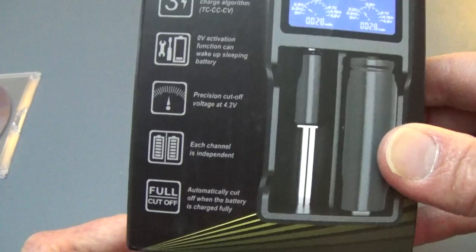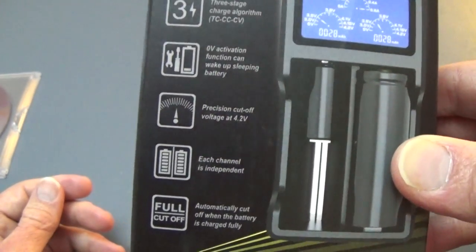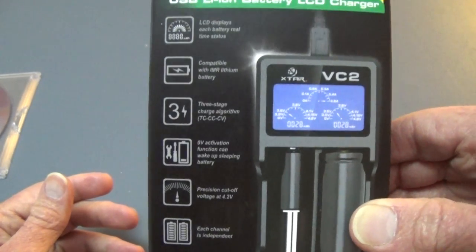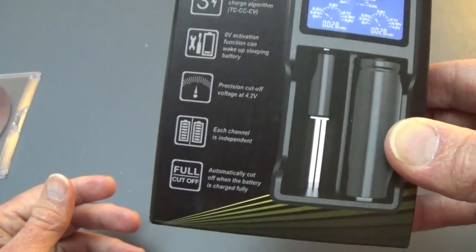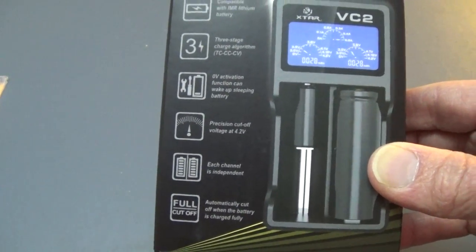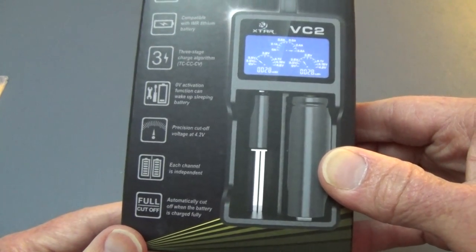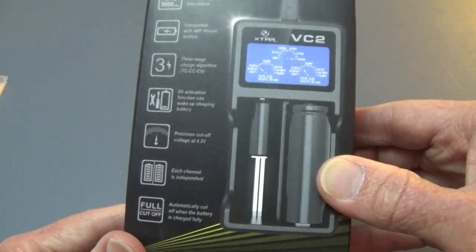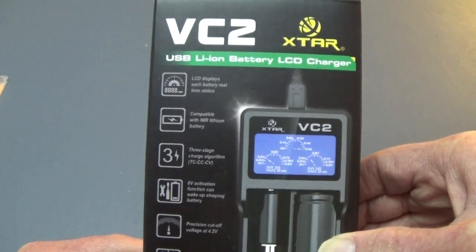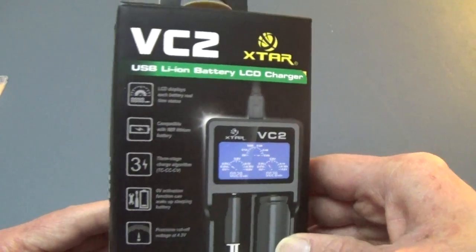As you can see from the box, it has a number of attributes which perhaps a couple of other chargers do not have. Now this isn't for NIMH batteries, which a lot of chargers that have come out recently are for, such as from Nitecore and so forth. This one is only for lithium-ion batteries, but it actually turns off as soon as the batteries are charged. Most chargers will run a trickle charge for an indefinite period if you leave the battery on the charger, but not this one — it actually shuts off. If the voltage should fall below 3.9 volts while sitting on the charger, it will wake up and start charging again to bring it up to the 4.2 threshold. It does constant current, constant voltage, as most do these days, and the display is what sets it apart.